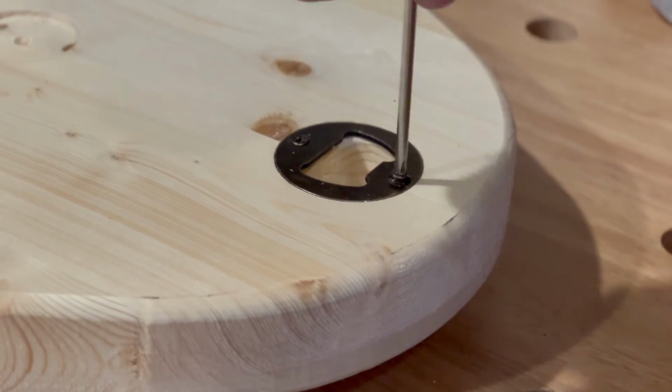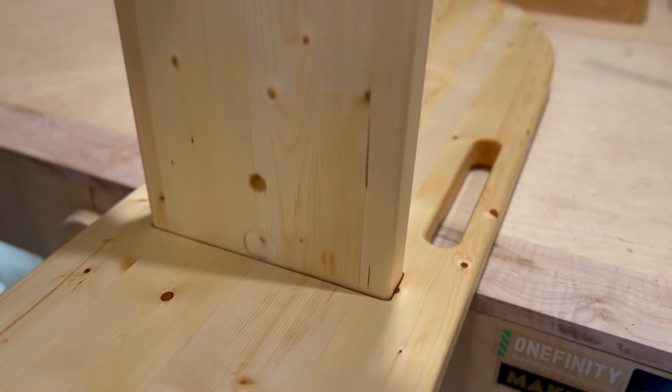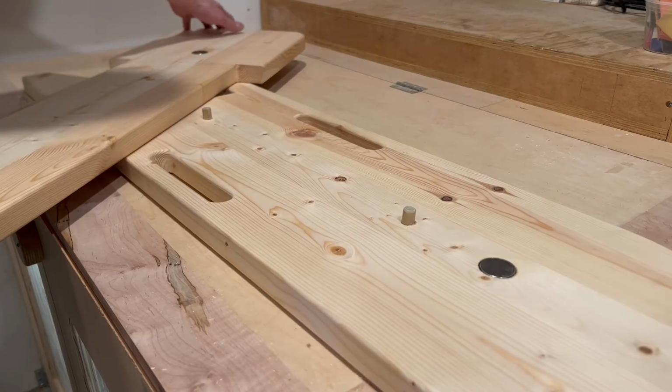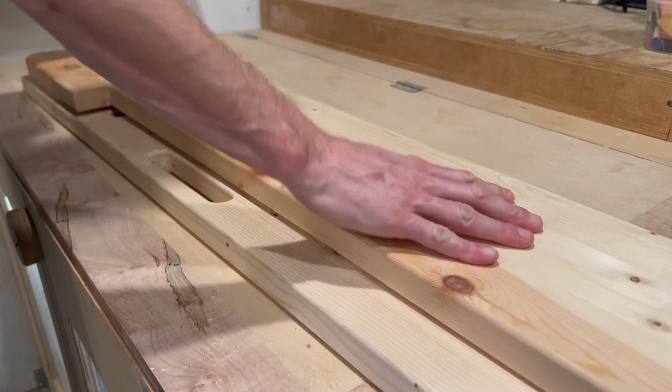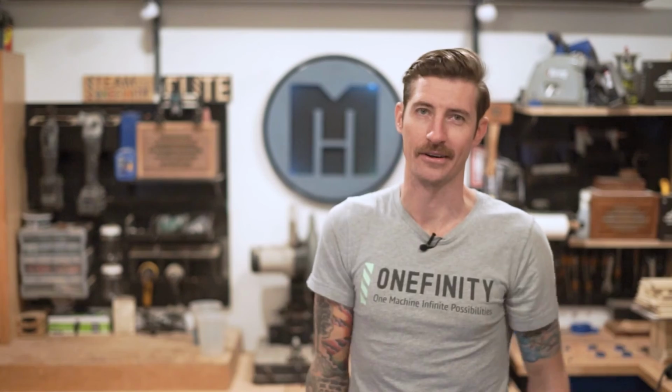You got to put the dowels into the back part because the other part, the one with the seat, needs to slide in and out of that mortise, and a dowel sticking out would get in the way, obviously. Once the glue's dry, stick the 2 parts together, and bring it wherever you want a comfy place to sit, and pop a squat. And look at that, now you're the coolest parent at the soccer game.